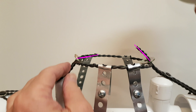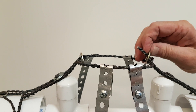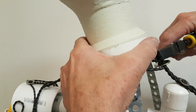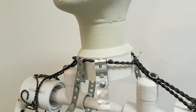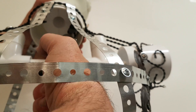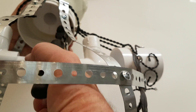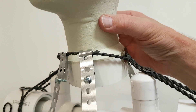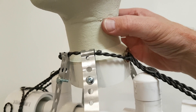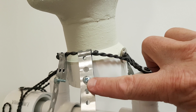With the two remaining upright portions of the wire neck bent downwards and with washers placed on them as spacers, carefully attach the head to the torso by placing these wires into the holes of the reducer. The wires might need to be cut a bit shorter to accomplish this. Once done and working from underneath, use pliers to pull the wires down so that they are both in a more horizontal position. The head should be able to pivot up and down. You may need to adjust the location of the metal tape and its connecting screws at the neck if you need more room for the head to pivot.